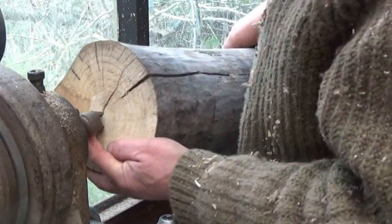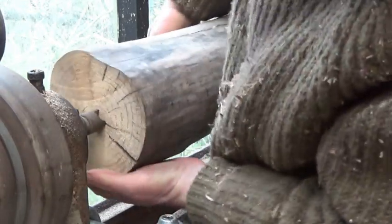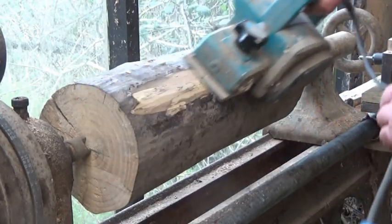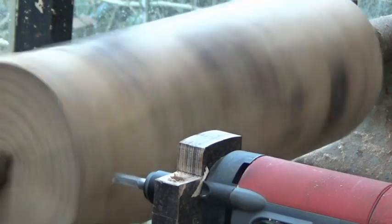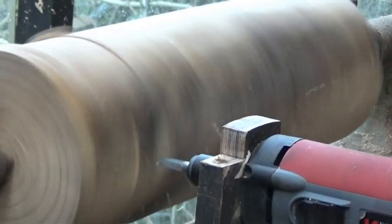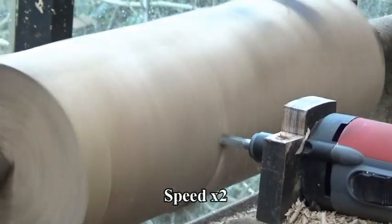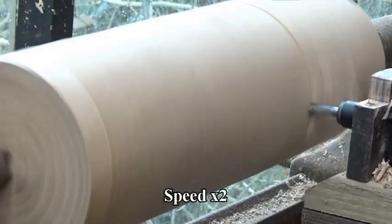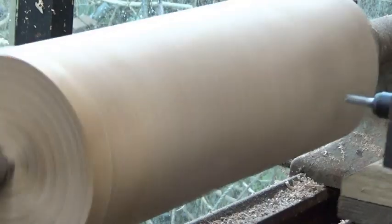This is my first test — a little bit exciting. It's just a log of spruce, and it's a little too big, so I planed it down so it would fit. If you're using a fixed blade like a gouge or a chisel of some sort, then you want the lathe spinning fast. But if you're using a router, then that's what should be spinning fast, so the lathe can spin quite slowly. With each pass, I unwound the limiter nut a half turn, and that seemed about right. I'm taking maybe a millimeter off each time — I could perhaps take off more, but I'm proceeding with caution.